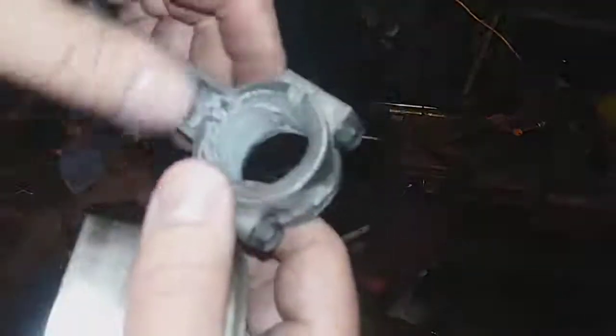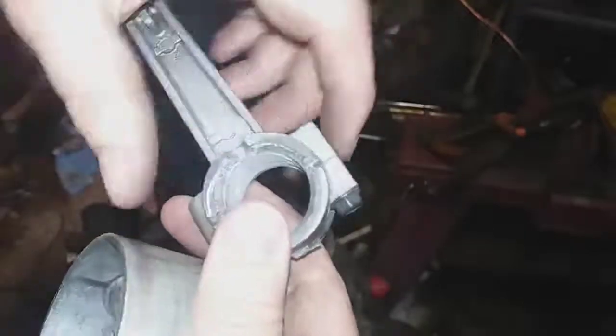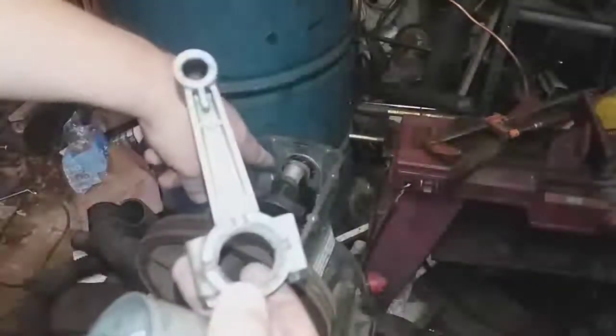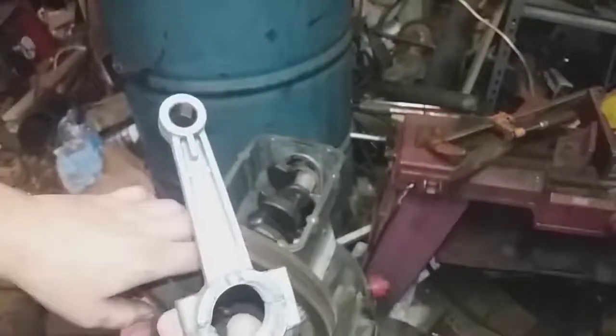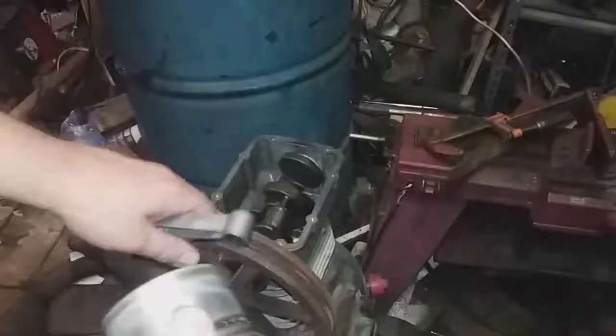It's all gummed up from lack of oil. The rings and everything - the cylinder wall looked okay, so I'm going to roll with it and hopefully it'll work out. I don't know if I'll need to put a little bit of hone on it. What I'm going to try to do is what they normally do with connecting rods - treat it just like a regular engine: face it down a little bit, a couple thousandths maybe from each side, and then it'll close it up. Then I can just take the boring head, open it up, and make it to the proper size. That's my plan - this is the connecting rod and piston from this air compressor unit.